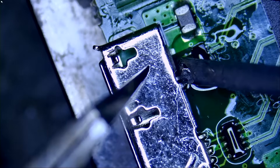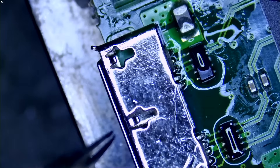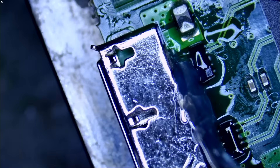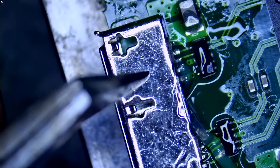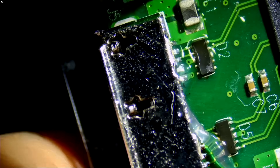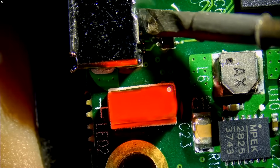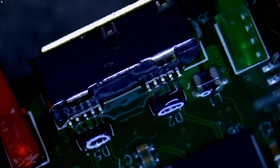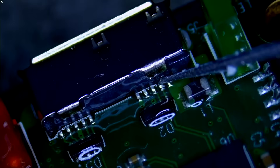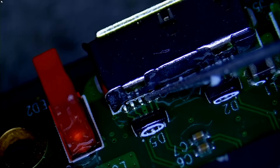Just look at how smoothly we are able to solder that connector with this precision pen. Let's clean the tip and go over this one more time. We're going to apply a tiny bit of flux — you can never have enough flux because flux helps with the flow of solder. Let's turn the anti-glare light on. All right, let's check and make sure the pins are good — pin number one, solid, solid, solid, solid, and solid. Amazing — we're almost done, we need to solder the back.